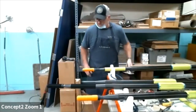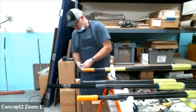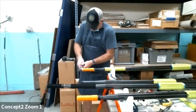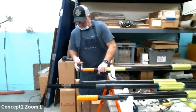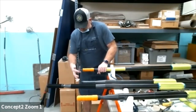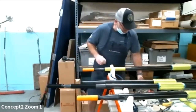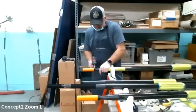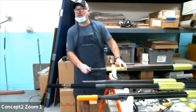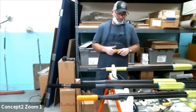What I do is I take vice grips, lock right on, and tighten right up to the screw. Now you can get a real good grip on the screw itself. And even though it's stripped, you can clamp it on really hard and you can turn it out. The screw will come out. Now loosen up the clamp screw — I hadn't done that before. Now you can slide the grip off. The grip is ruined, but it did not hurt the handle. So you can install a new grip right over it without any problems. That's the best way to fix one that's been stripped.